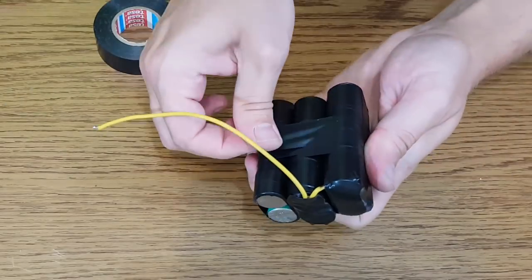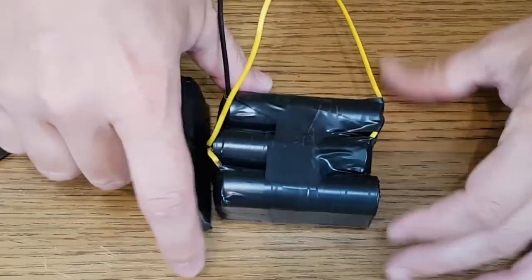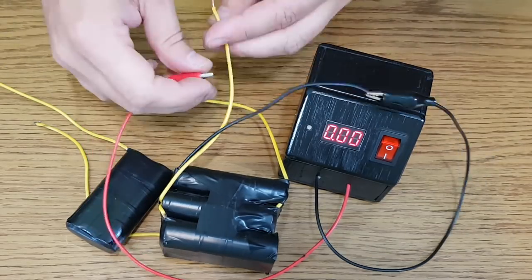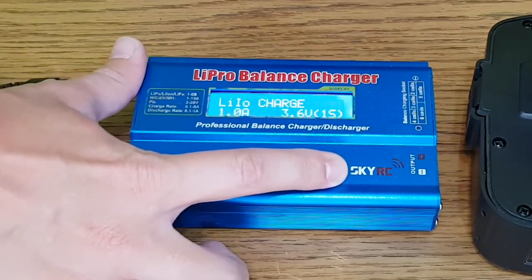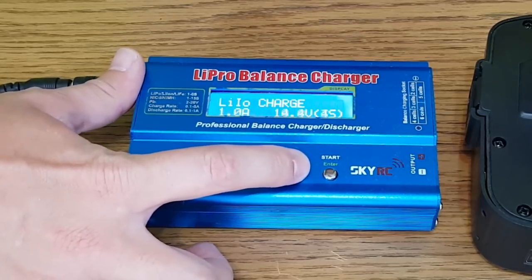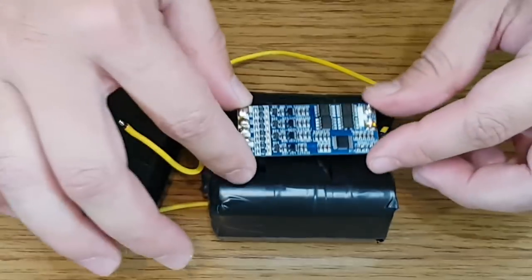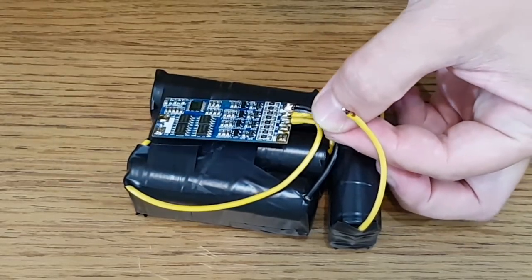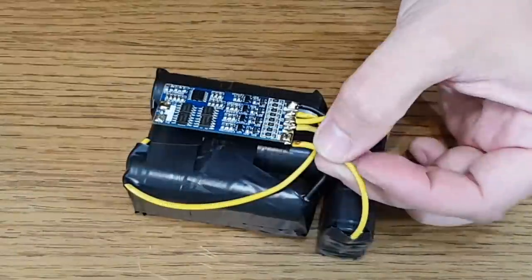Now I need to figure out how I will fit them in the battery holder — I think this is the only configuration. For all battery connections I'll use thick wires from power supply units. For charging, the best solution is the IMAX B6 charger, but I want a simpler dedicated charger for this drill. So I'll use a BMS board which has all the protection features I need, and most importantly a balancing function. Another important feature is the over-discharge protection, which activates when the lowest cell drops to 2.7 volts — not 2.5 volts like other protection boards. This is important for high-current drain devices where voltage can drop suddenly.